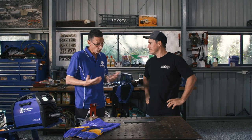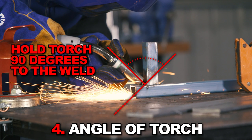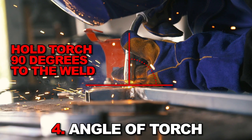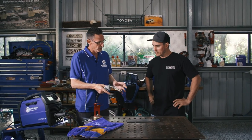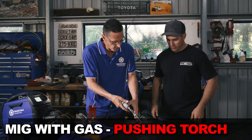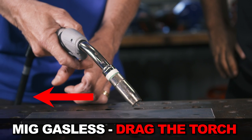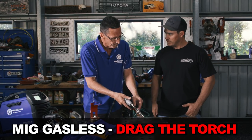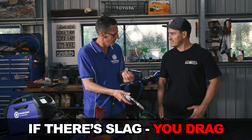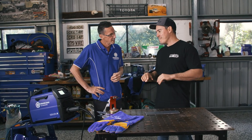So Jason, what's the first tip you can give someone if they want to lay a nice weld? It's really important to get the angle of your torch right — the angle makes a huge difference to the quality of your welds. Ideally you want the end of the torch as close to 90 degrees to the weld as possible. With MIG and shielding gas you want to be pushing the torch so the gas is aimed directly at the new weld; with gasless it's the opposite — you drag the torch. There's a saying: gasless wire creates slag, so if there's slag you drag. A push angle of 10 to 15 degrees is fine for optimum gas coverage.